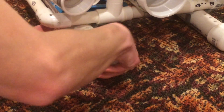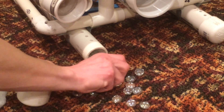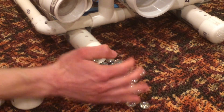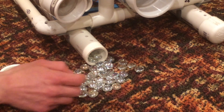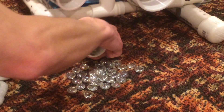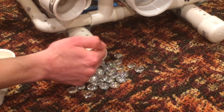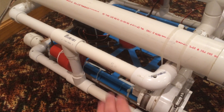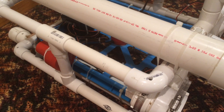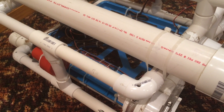The end caps can be taken off the skids on the bottom, revealing aquarium pebbles I've been using for weight. If you need to make the submarine heavier, you can add a few more; lighter, remove some. I've also drilled holes in the skids to allow water to leak in, as they're not meant to be watertight. The PVC pipe frame is a wet frame — not meant to be waterproof — with small holes drilled to allow air bubbles to escape so they won't affect the buoyancy.